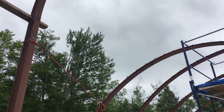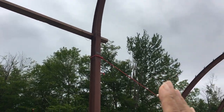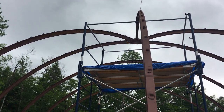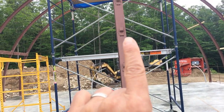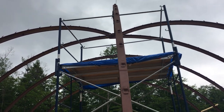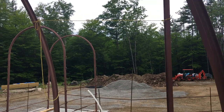So the rebar is a challenge. Somehow we have to bring this dome straight over and attach it to the curved part of that dome. And that's not gonna be so easy. This beam here that you see, that goes all the way up, that beam's not even going to stay there at the end, so we can't attach anything to that. That gets cut out. I think I figured out a plan.